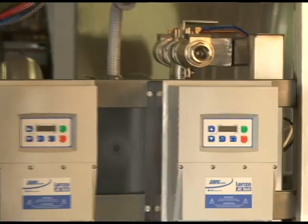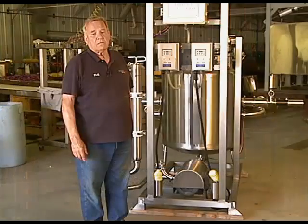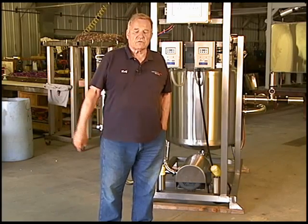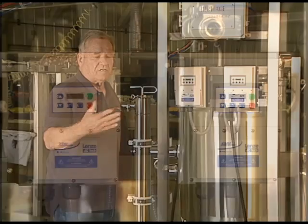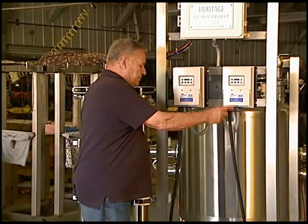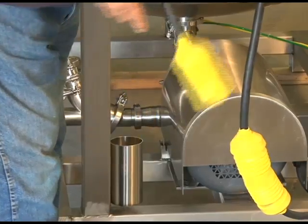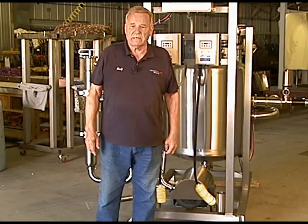Next are two frequency drives — the latest drives on the market, built in Germany. The frequency drive runs, in this case, a 10-horsepower milk pump. Not only does the frequency drive regulate the speed of the pump, but it protects the pump at the same time — the frequency controller picks up problems and shuts the juice off. Why two frequency controllers, or variable speed drives? It has to do with large dairies — you cannot be down milking at any time. We understand you milk 24 hours a day, three times a day, seven days a week. If something happens to this drive, there is a twist-lock plug. You undo it, pull the spare out, redo this one, shut the power off on this drive, turn the power on on that one, and you are back in business. No tools required, no other training required.